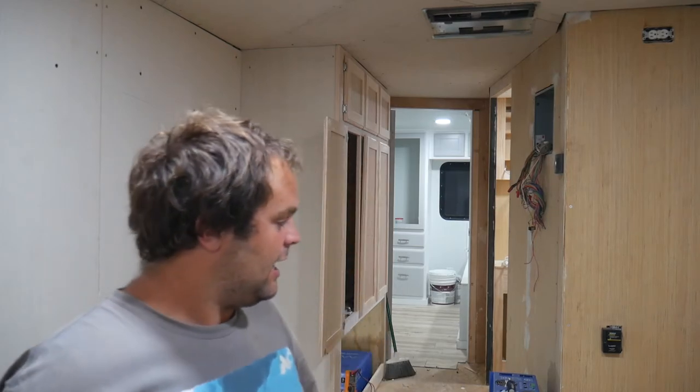So anyway, I want to back up for some of y'all that are kind of new. My generator is a 100 horse Detroit. It's got an air compressor made on it, so it builds air through the coach when you start it. And it's got two speeds. It's got a 28 kilowatt generator head on it. At 1800 RPMs, it makes effectively an unlimited amount of power for a motorhome.